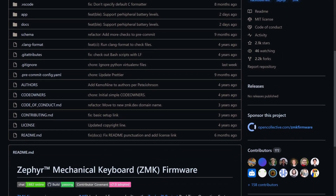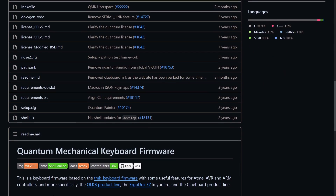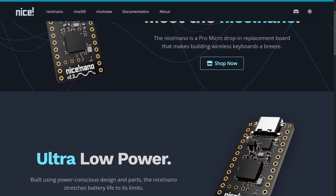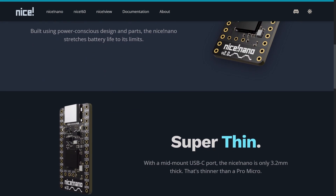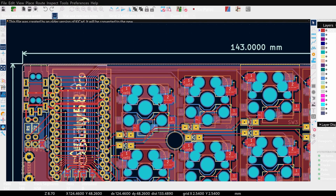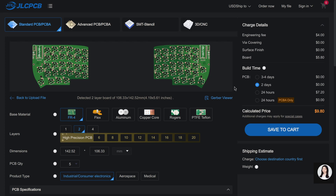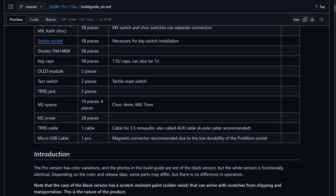They both offer similar features, but in my opinion QMK is a little more mature because it has been around the longest. The reason it's important to determine what firmware you want to use first is not only because different firmwares have different features, but also because they support different chipsets. I personally opted for ZMK firmware using a Nice Nano board, because the Nice Nano supports Bluetooth, which is an awesome luxury to have on a custom keyboard. For the parts, I downloaded the PCB available on the GitHub website for the Lily58 Pro and uploaded that file to a PCB manufacturer, which made the PCBs and shipped them out to me. Then I just bought all the other parts listed on the GitHub website wherever I could find them.